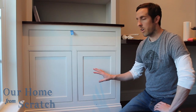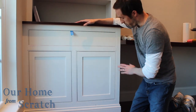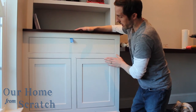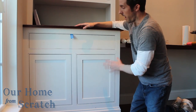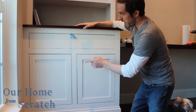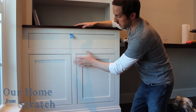Let's start our tutorial with the face frame. The face frame consists of two stiles — one on each side, these vertical pieces — and then there are the rail boards: a top rail, a divider rail, and the bottom rail. Because this has a bead feature, the stiles get the bead on one side, the top rail gets it here, the bottom gets it on this side, and the divider gets it on both sides.